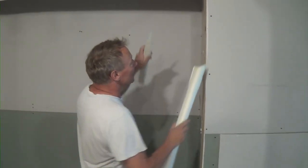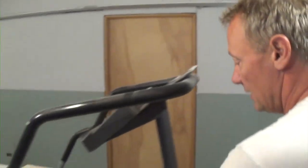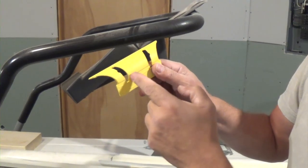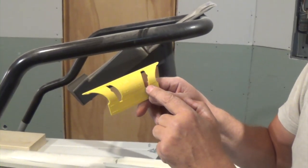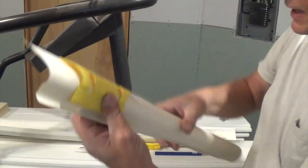I'm not putting any bullnose in this basement — I haven't done bullnose in quite a while. But it gives you a very nice corner. If it's a 45 and it's like this, that's where these marks come in. You use these for 90s, and these for 135s or 45s. When I put this on here and mark it, now I can have the off angles that I need.